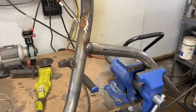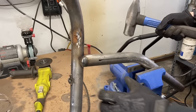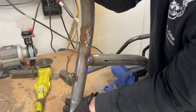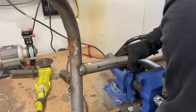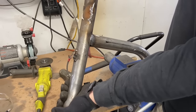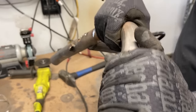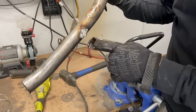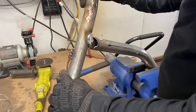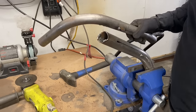A way to test the strength of your weld is to try to cut it loose — get a hammer, beat on it, try to break it loose. If it breaks loose, try again until it doesn't. If the tubing fails before the weld does, your welds are good. I'm going to try to rip this off. You can see the tube is ripping — my weld is stronger than the metal I'm welding to. Now I'm going to cut this little tab off and show you gap welding.